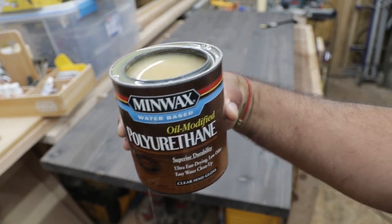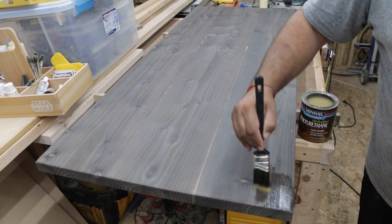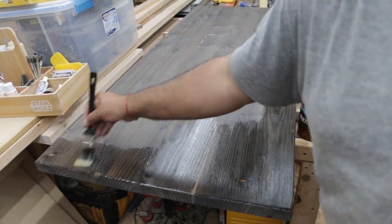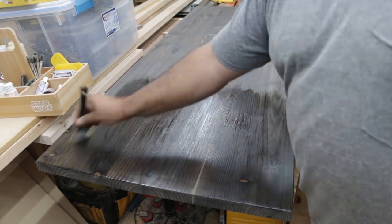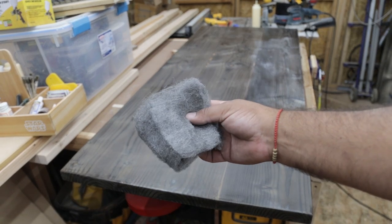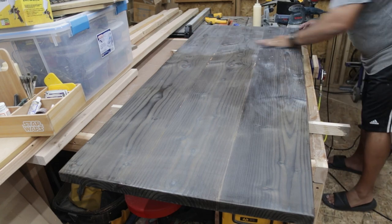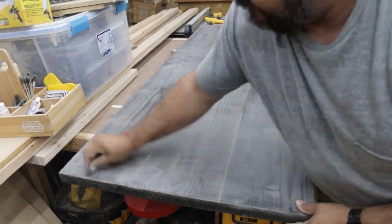Here I am trying to show off my polyurethane and making a mess spilling it all over the place. Luckily I had about two feet of wood shavings on the ground from the planer to soak it all up. I got a cheap synthetic brush and I'm brushing the polyurethane on nice and even, making sure I don't have any brush strokes or any sawdust trapped in the polyurethane while I'm putting the first coat on. After the first coat dried for about two hours, I got some really fine grit steel wool to knock down any rough edges or defects from the first coat and went over the whole board to give it a nice glassy smooth finish.